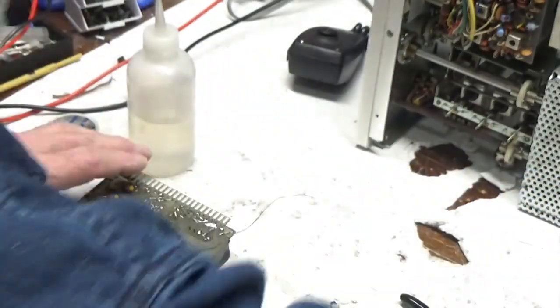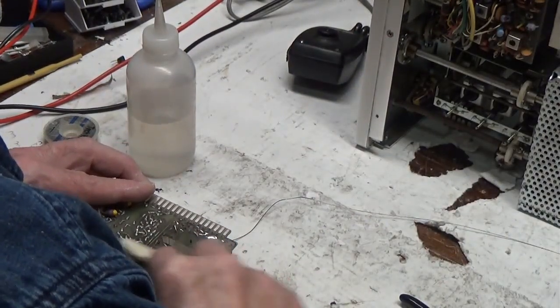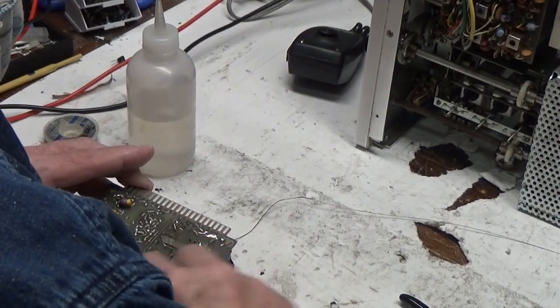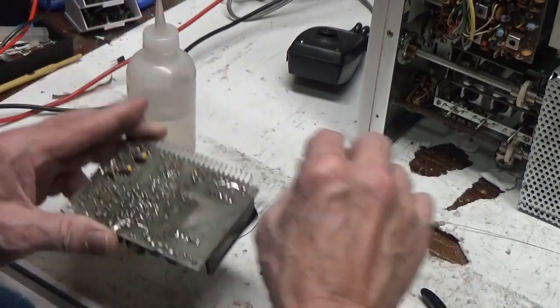So it was leaking and half-turned on that other transistor — not all the way to ground. Let's get a little squirt of flux so the next person that comes along knows work has been done here.